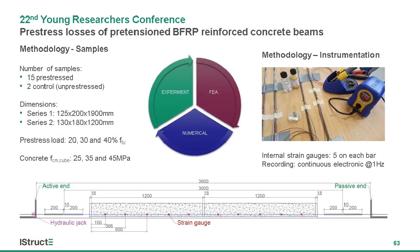The project is a combination of experimental and theoretical approaches through finite element modeling and numerical analysis. We tested so far 15 samples. The first series was 1.9-meter long beams with a cross section of 125 by 200 millimeters. The second series had shorter samples to simulate a production line of two samples on a single pre-stressing bed, as shown in the sketch at the bottom of the slide. We also investigated the influence of different concrete strengths. All bars were equipped with five strain gauges each, allowing us to monitor deformations continuously throughout all experimental phases.